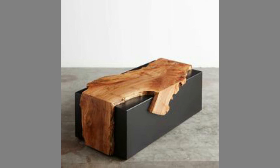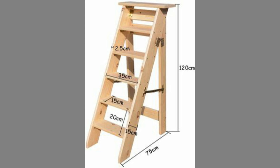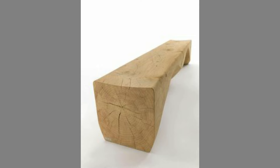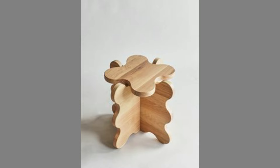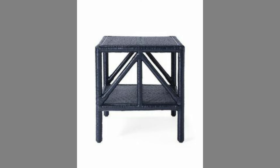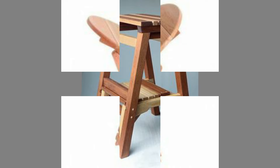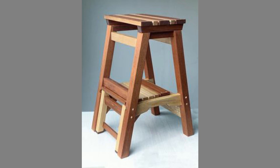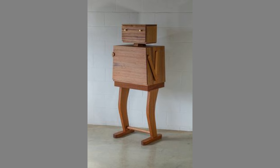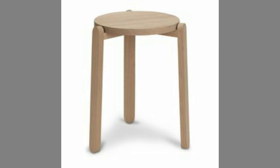While there are an abundant number of hardwood species, only 200 are common enough and pliable enough to be used for woodworking. Hardwoods have a wide variety of properties, making it easy to find a hardwood to suit nearly any purpose, but they are especially suitable for outdoor use due to their strength and resilience to rot and decay. The coloring of hardwoods ranges from light to very dark, making it especially versatile for aesthetic purposes. However, because hardwoods are more closely grained, they are typically harder to work than softwoods. They are also harder to acquire in the United States and, as a result, are more expensive. Typically furniture such as tables and chairs is made using solid stock from hardwoods due to its strength and resistance to warping. Additionally, they also have a greater variety of grain patterns and color and take a finish better, which allows the woodworker to exercise a great deal of artistic liberty.